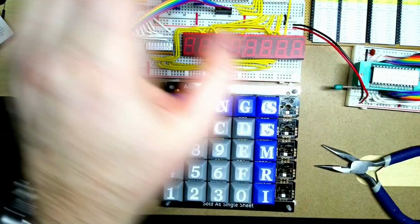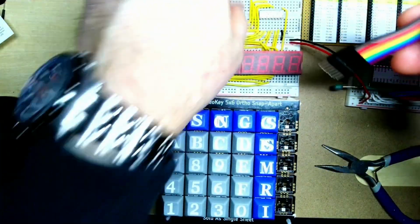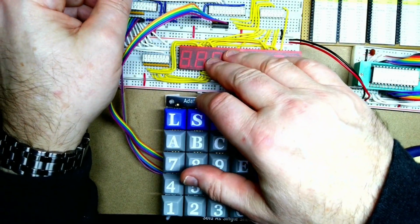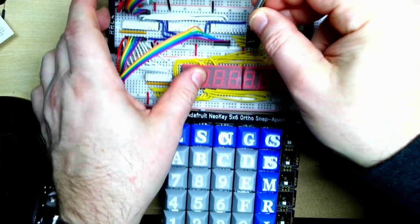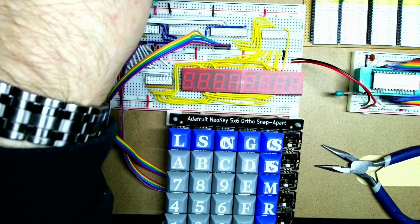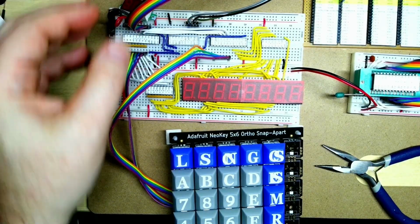So now we're going to just plug in the main data bus coming in from our strip board bus rails over to the right hand side there, and then the control signals as well. And I did need to add the DTR signal into there as well a little bit later on when I changed the configuration. The DTR line was on the left of that connector there as well.